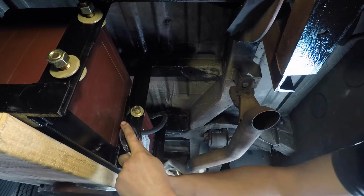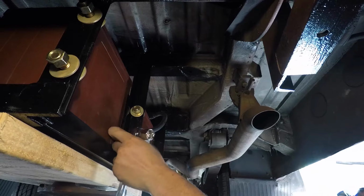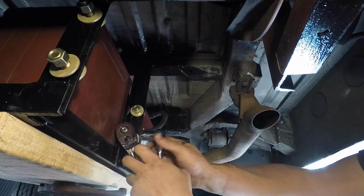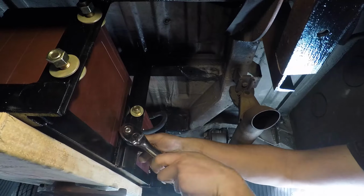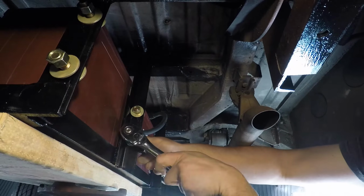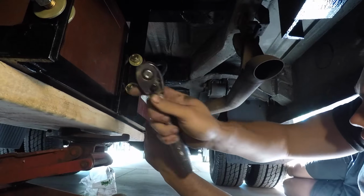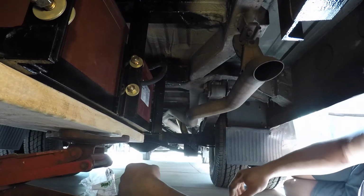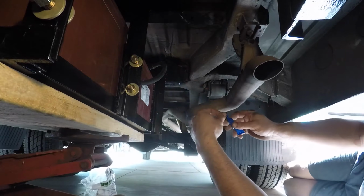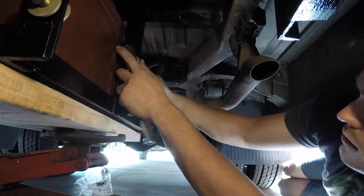And so you might think that it's very difficult to water all four of these batteries, being that they're hard to reach, but I actually have a watering system installed on them. So there's a small nozzle that comes out near the trailer hitch, and I simply hook up a little tube to that about once a month and put the other end of the tube into my distilled water, and I just lightly pump it until I can no longer pump, and all the batteries get watered at one time. It's a really convenient way of watering these batteries.